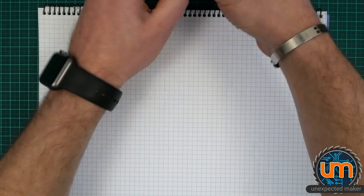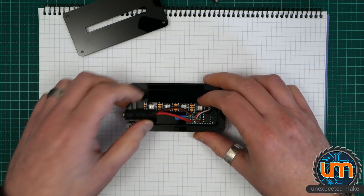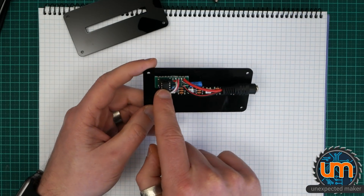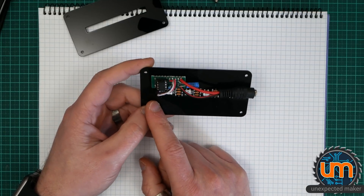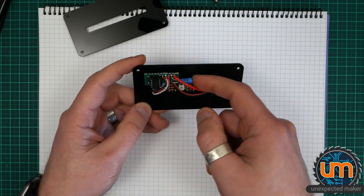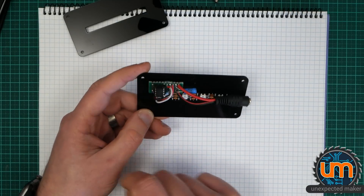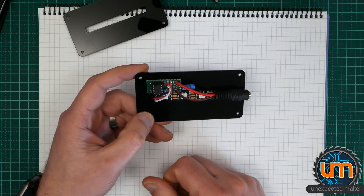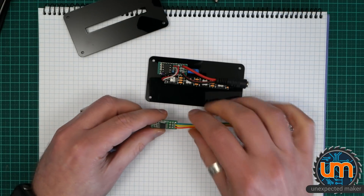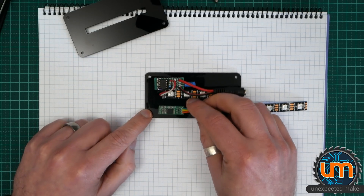Let's have a look at the electronics inside and see what we need to produce. Here it is with the lid off. Some of you might remember that I hand-built the microcontrollers for these — the little boards. There's an ATtiny85 — they're called now, Microchip owns them — on some perfboard. I've got a resistor going through the data line to the RGB strip, a capacitor for filtering, and my 2.1mm jack. That's pretty time-consuming to make; I don't want to spend my time making things on perfboard.